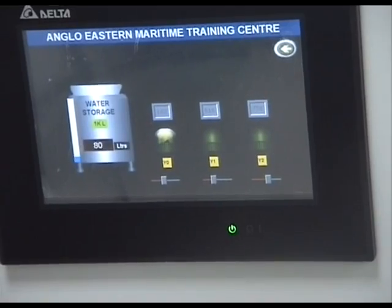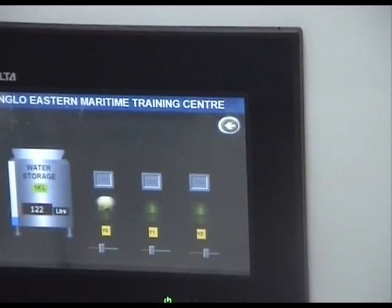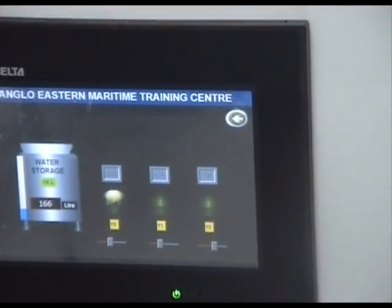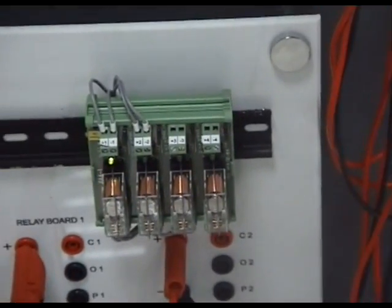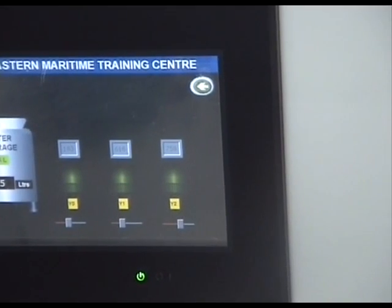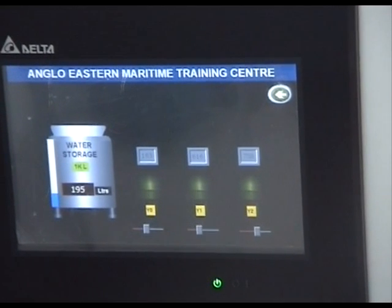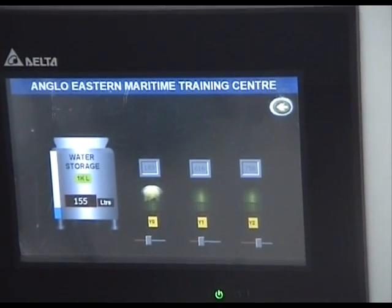The current signal is going up — you can see it increasing on the meter and also on the display. Y0 is already on. We increase the current signal further, and you can see that Y0 has gone off — meaning the water level has crossed the threshold point of 183. Let me bring it down again to show that Y0 will come on again. There you go — that's your alarm, Y0. We could use this output to connect to an annunciator in an extended experiment.